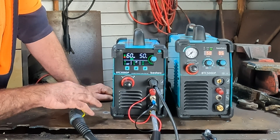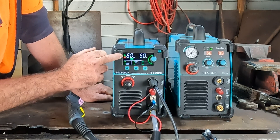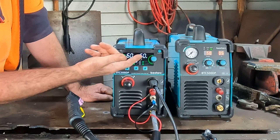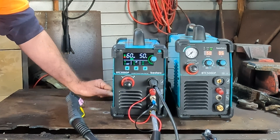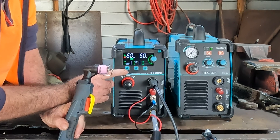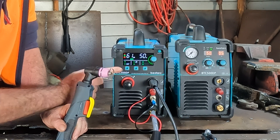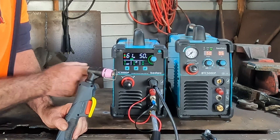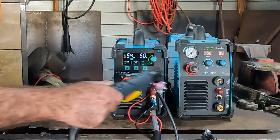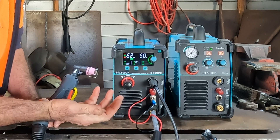I know why it's taking a little while to reset - I haven't pulled the trigger on the gun to release the air from the line. So we've got 60 PSI and three greens - that's telling us we're all set to cut at that air pressure for 50 amp. We've also got cut mode and air mode. When you select air mode you can blow down your table before you get ready to cut - use it as an air gun. Are these things getting more technological or what?